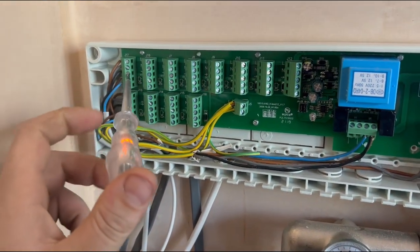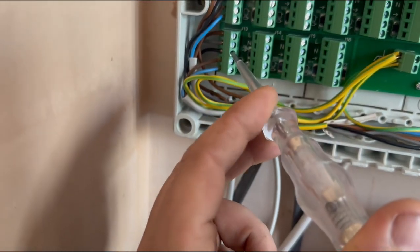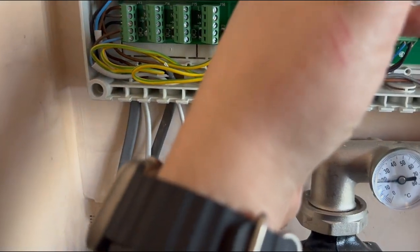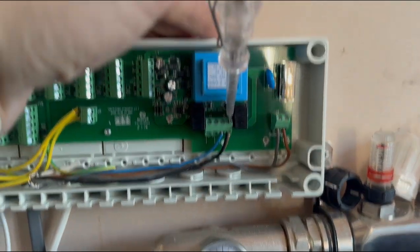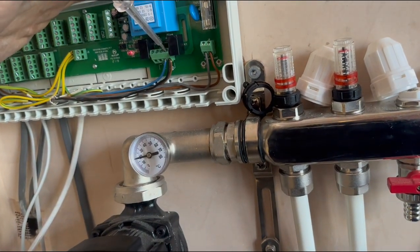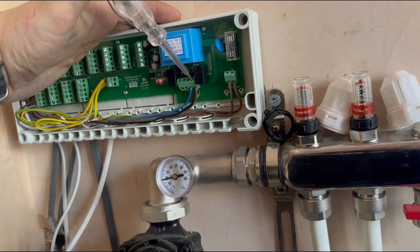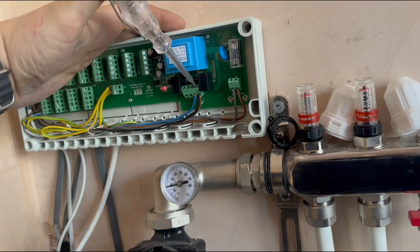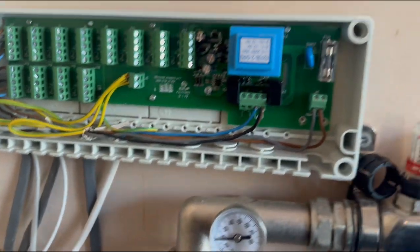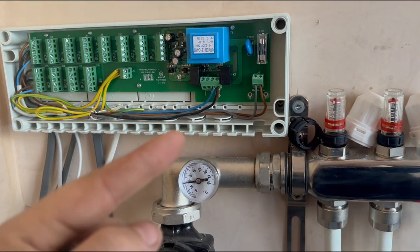What I've done is put it in with the pump, because the pump has to kick in with either zone. So if you turn either of those stats on, this will come live, the pump will kick in. Turn that up to say 20 degrees — so this black should come live, which it has. The actuator should come live too. The other one is dead and that actuator is dead. The pump should then kick in as the relays do their thing. This pump is mega noisy for a new pump. It should be firing the zone valve now — the black goes up, hits the micro switch in the zone valve, comes back out on the orange to fire the boiler.